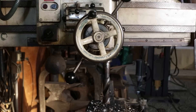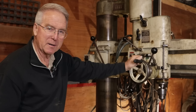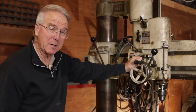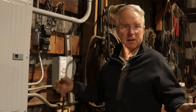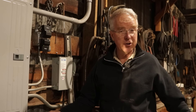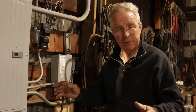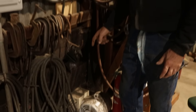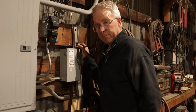Let me show you how this thing works, the features it has, and let me ask you a ton of questions because I'm not a machinist and I'm counting on you guys to keep me from wrecking this thing now that it's been in the shop 15 years and probably needs some TLC. The first hurdle if you want to add a machine tool — a lathe or a milling machine or a radial drill — to a carpenter shop is you need three-phase power. I didn't have three-phase power, I had single-phase, but a rotary three-phase converter, which is this little dusty monstrosity right here, will trick your single-phase electricity into three-phase power.